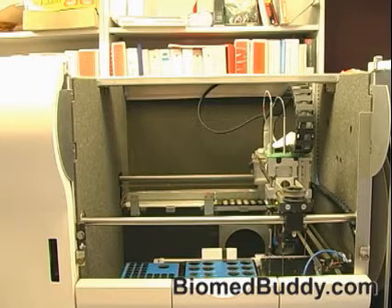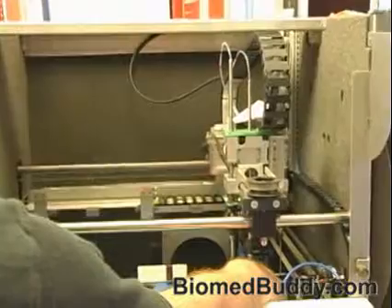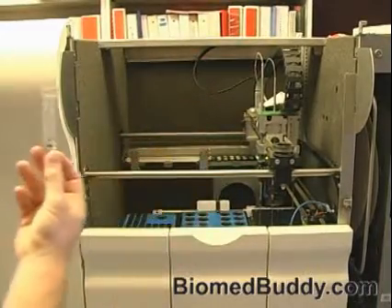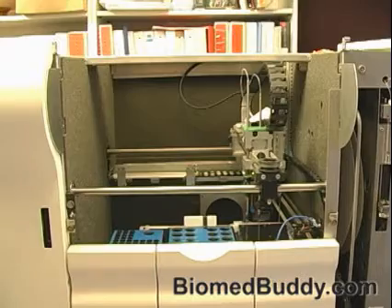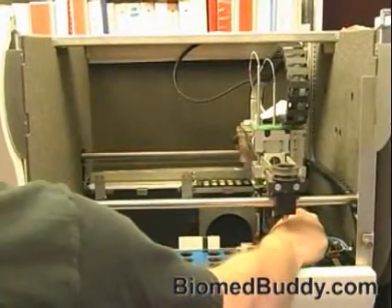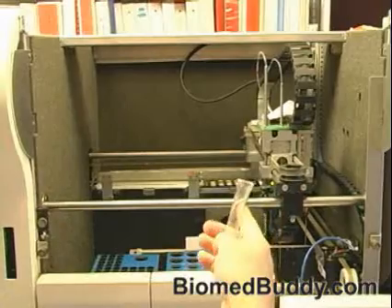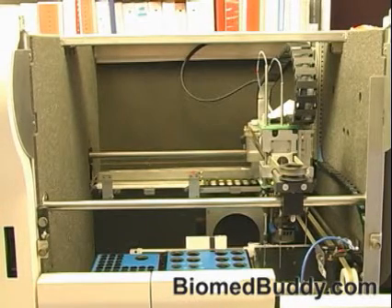I'm going to try the same thing for needle number two. For the most part it should be approximately the same amount — there shouldn't be a drastic difference between needle one and needle two. There's only one Valco pump; it sends solution through each needle, so it should always be the same. If for some reason it is not the same, that's an indication of a bad needle. I'll do the same for needle number three. That's just a quick way of checking that your needles aren't clogged. If I saw a big difference in just one of them, I'd look into it. So now I know my Valco pump is okay and I'm pretty comfortable that my needles are okay.